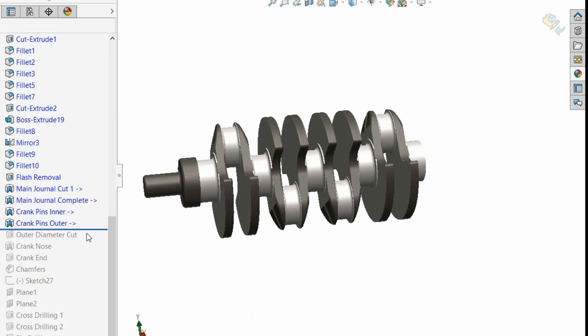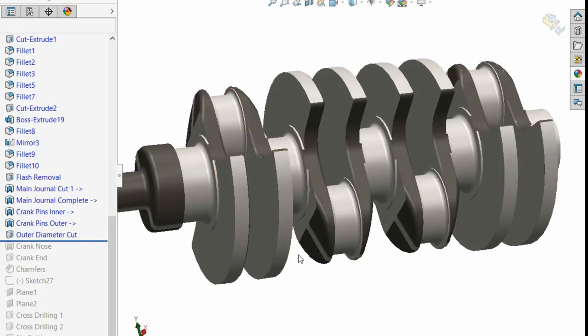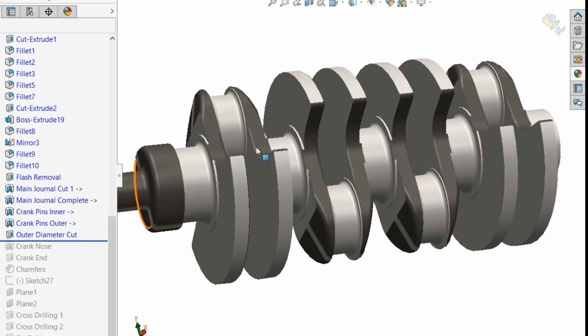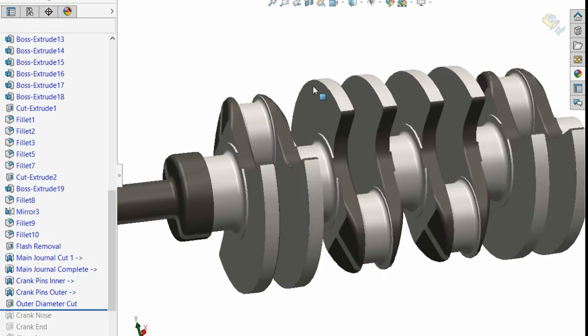Once we've done that, like I say, we cut the outer diameter, so this section here, we're just going to cut that there. And these aren't in order, right? So you could start with your crank pins first because they're offset, and then as soon as you've done that, stick it between centres and away you go. Or like I say, not between centres, the chuck can have two positions where it is concentric with the centre of rotation and then concentric with this and then this. It just depends. Or if the head moves, you just follow, trace the circle, that kind of thing.